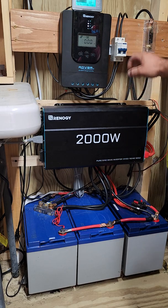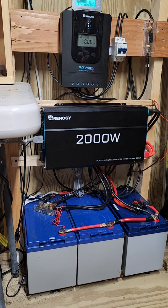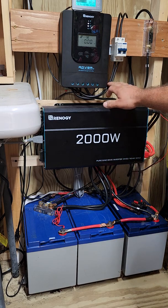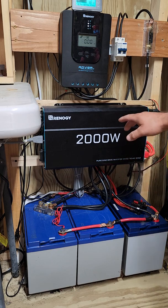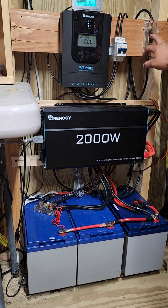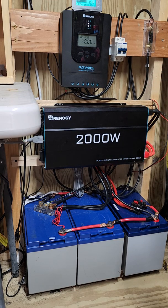On the right I have my PV breaker — it's a 40 amp, 600 volt dual-pole breaker, so if there's an issue on either the positive or negative side it trips. That feeds into my MPPT controller via 10 gauge wire. I can run 10 gauge with 600 watts because my voltage is higher, meaning the amperage is lower — I could run up to 30 amps through those 10 gauge wires without an issue. Those are the original wires from my 400 watt setup. Where I did have to upgrade was the wire going to my batteries, which I upgraded to 8 gauge with a 40 amp fuse.